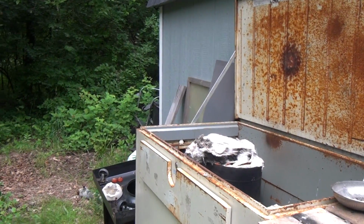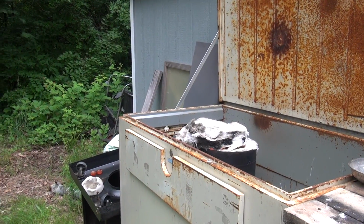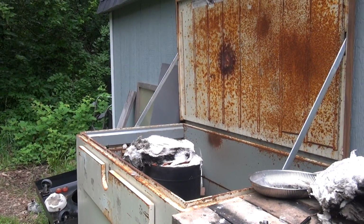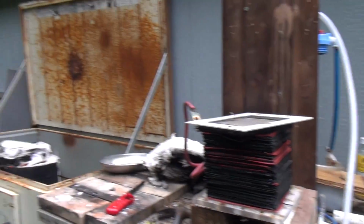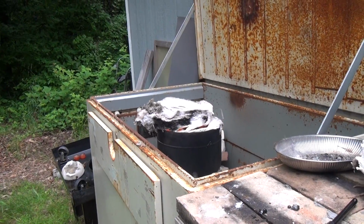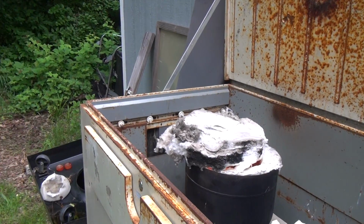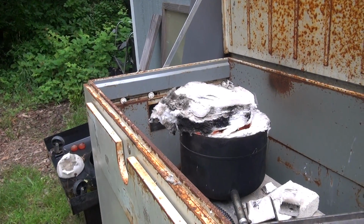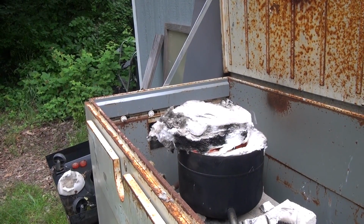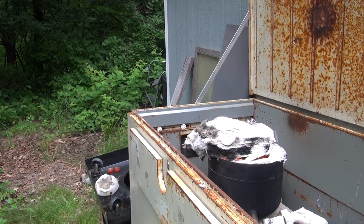So I had some material that I had mixed up with flux a long time ago. I put that in one of my medium-sized crucibles. I melted it. I poured it into the cone mold. I then broke it apart, separating the metal from the flux. I then took the metal and put it in a cupel, which I have inside of my metal crucible, because I tried heating up the first cupel and it fell apart. These are homemade cupels that I made by buying bone ash and making my own.